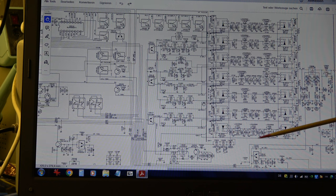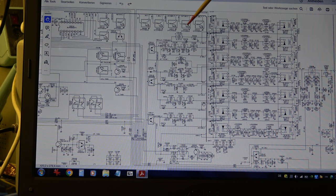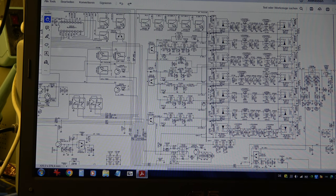Here we have the output and input bandpass filters. These bandpass filters are used for TX and RX direction, and we have seen that the RX mode is okay on all shortwave bands. So we can assume that these components are also okay for transmit. The relay itself - we could assume the TX contact is not the same as RX and could be burned. But we have a problem in three bands, and interestingly one relay is for both 10 MHz and 14 MHz. On 10 MHz we have a problem, on 14 MHz we have no problem, so it cannot be the relay.